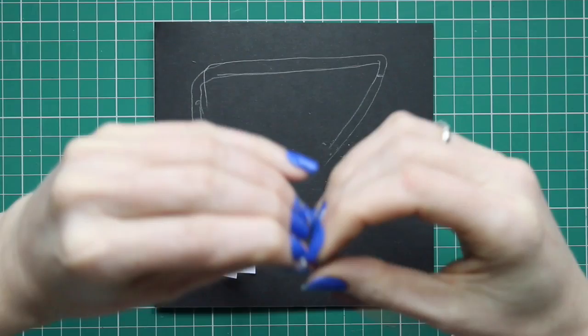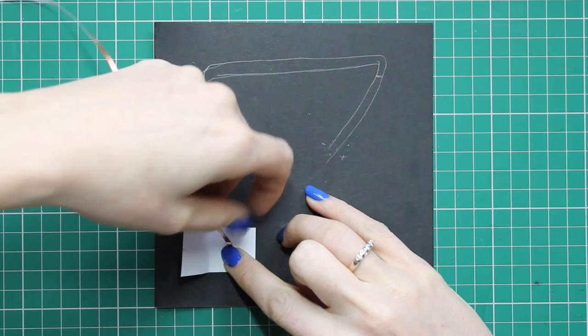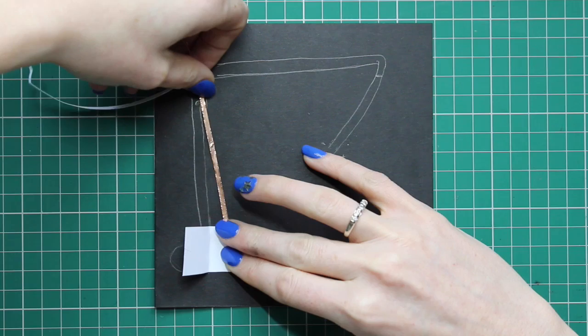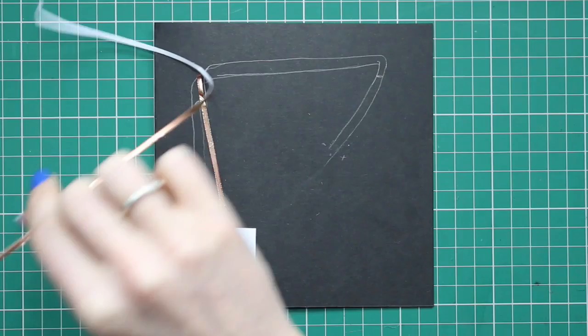So simply take the foil and peel off the backing. I'm going to start with the negative side. So I'm just going to lay it down, roughly following our line. It's a little bit fiddly at our first dot where our LED light is. Make sure that you really smooth this adhesive down. The smoother it goes on, the better.